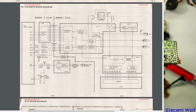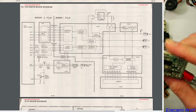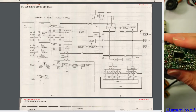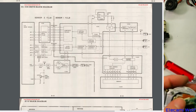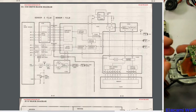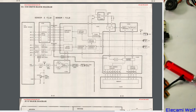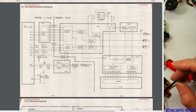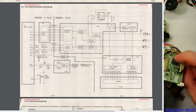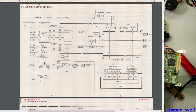So there's the video signal. And then the amps, sample and hold, gain, emitter follower. So then that must come off of this connector here, BA1251. What it says here. So the video signal. I can't even see that stuff. Yeah, that is the pre-video signal they talk about there, coming off the sensor board. So then this sensor 1 PCB must be the next thing down the line. This one here. IC201, yeah, that thing there is this stuff here.